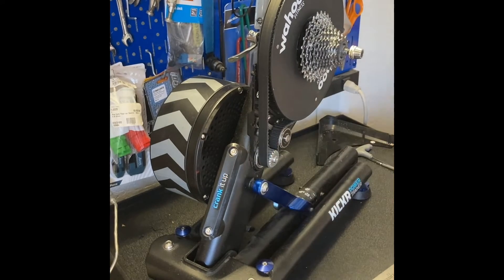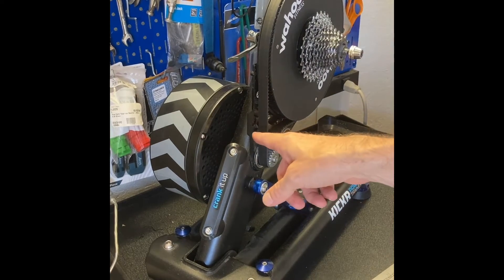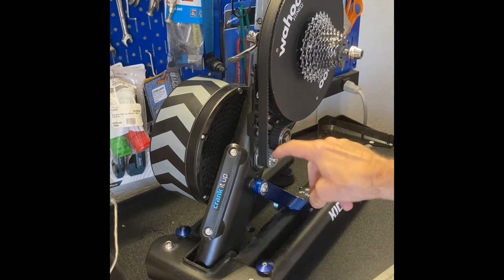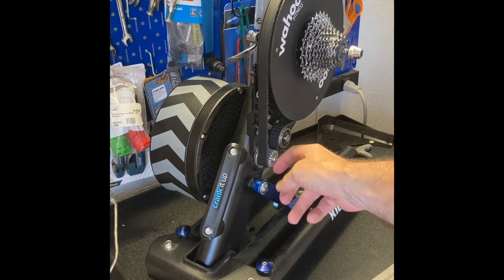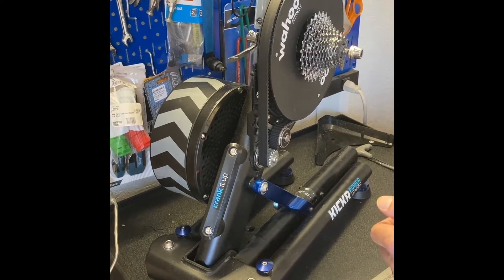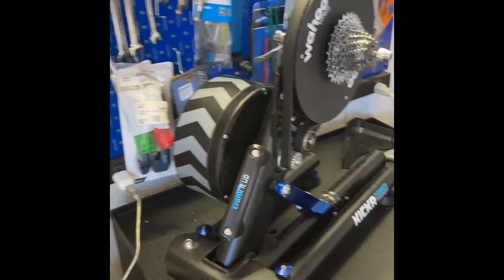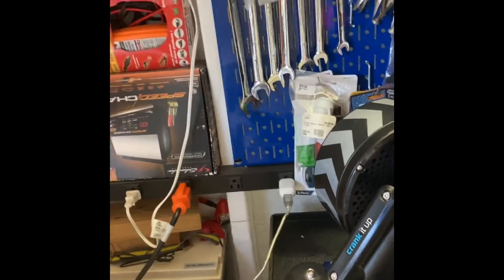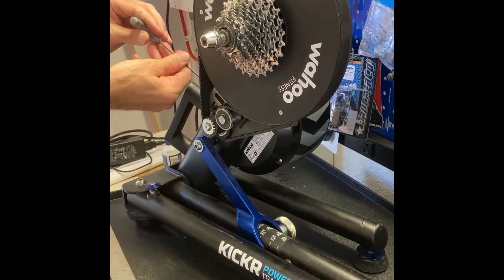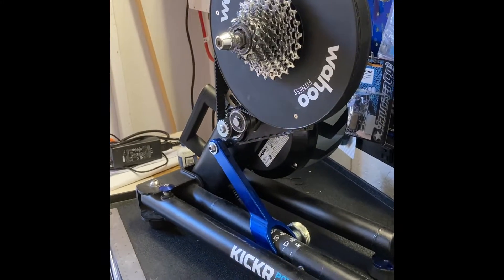That was another three millimeter screw. Next step - I'm probably going to be reducing the tension on this belt so I can go ahead and take the belt off, which will give me access to the bolt here. The threaded bolt on these versions - rather than like version five that has a key pin, this one here just has a screw-type gearing. So let me get to that. That's going to be another three millimeter. Here you'll notice three millimeter to reduce the tension here. I should probably mark where I'm at - let's get the sharpie out.